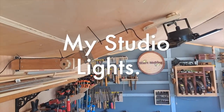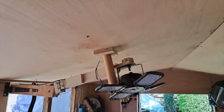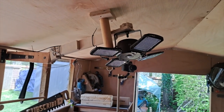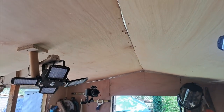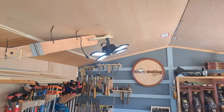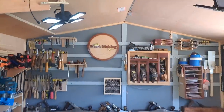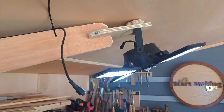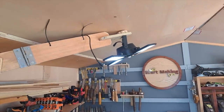This is one of two arms I've got with lights on them. The light is very intense. The second arm will cover both of my workbenches — it swings from one to the other and it's probably the one I use the most. Now you can see that it's not on — it's run out of power. These are basically outdoor solar-powered security lights. You get about two hours of good light from them each, which I tend to use separately to stretch out four hours total. There's a solar panel through there connected into the light. The wire is not attached because you cannot charge at the same time as being on — and this is why it only has two hours' life.